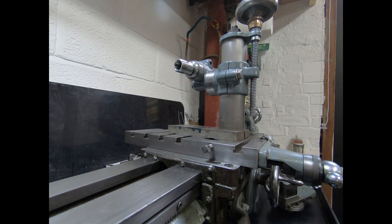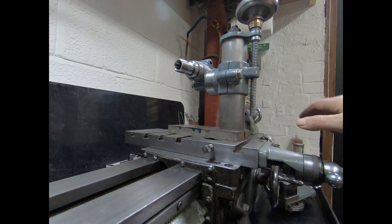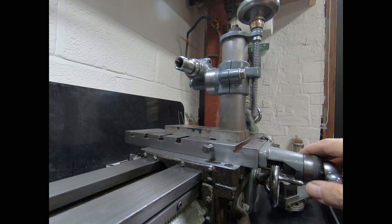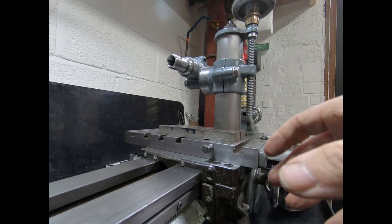If you're finding this mildly interesting I'd definitely have a look at John's video, because it goes into the logic of what he's done and you can see the finished result. I'm quite excited about this because it's quite an elegant solution — you're using a lot of the existing design of the Myford. If the lathe is strong enough to hold your compound slide, it'll be strong enough to hold this, and you're using the same bolts to lock everything off. You're not creating new work and it's relatively out of the way.